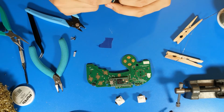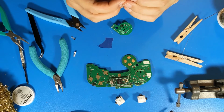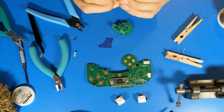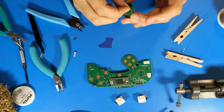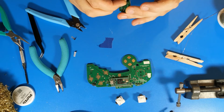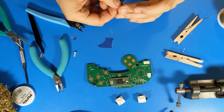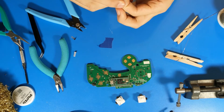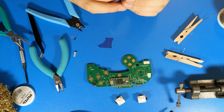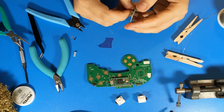We suggest with these larger magnets that you put them fairly low down. On this prototype board, the spacing of the holes is a little bit too wide relative to the spacing of the pins on the actual sensor, but in 1.2.2, I believe this has been rectified, and it's easy to lower the sensors all the way down to the surface. It is, however, not strictly necessary. So at this point, you try to make sure that the sensor remains perpendicular.